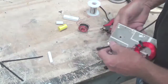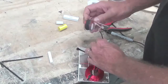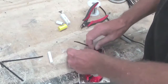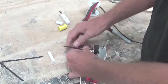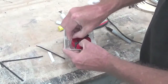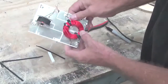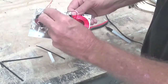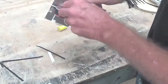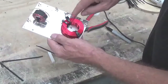I really like this board for building Bill's crossovers — it's easy and it works really well. Make sure you get your wires oriented so you know they'll reach where they need to go. Now make the connections: this coil connects here and here; this one connects here. The ground pad is where the coils go to ground. This coil goes to the woofer — it's the actual coil that does the filtration for the woofer, so it goes to woofer positive.